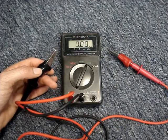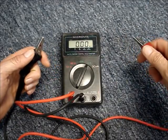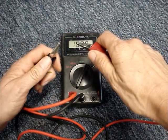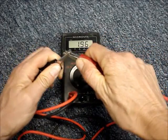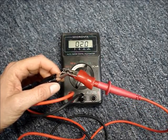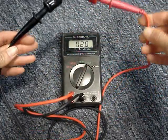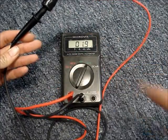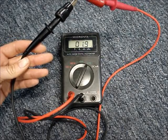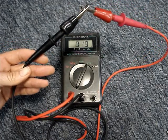The first thing is to make sure that your multimeter and the leads are in good condition. With the multimeter leads plugged into the correct sockets and positioned into the K-ohm range, click the leads together and you should read maybe one or two ohms on the display. Then wiggle the leads around and ensure that the reading does not change. If it jumps around, then it's likely that the meter leads are broken and you'll need to replace those before continuing on to the next step.